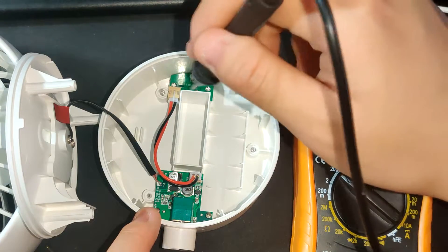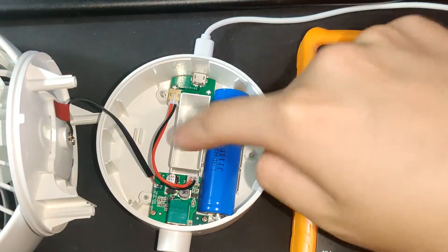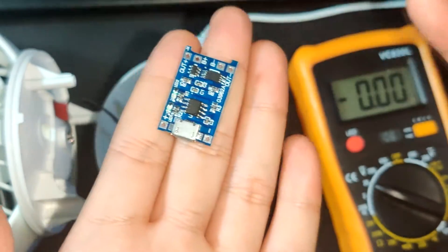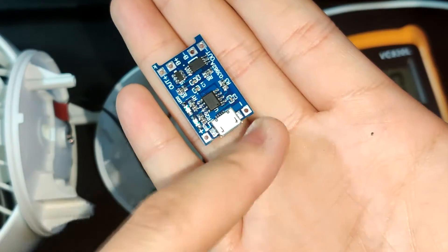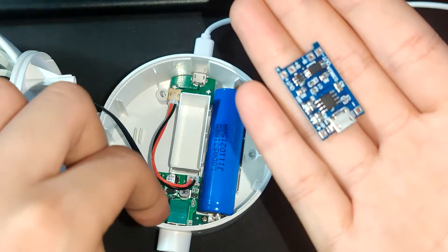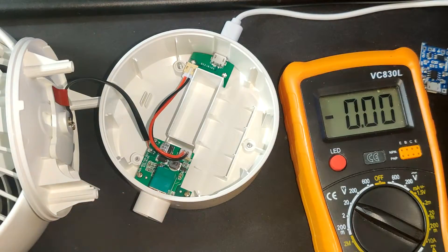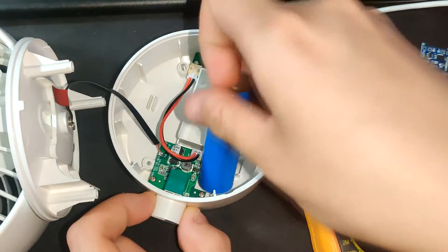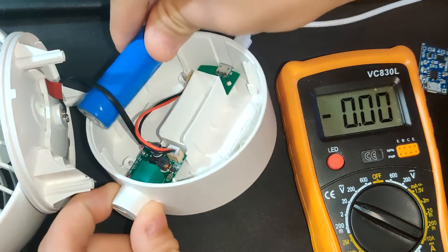It's just a power line so it doesn't need a huge motherboard. I'm going to see if I can put an LG 18650 battery into this and make it battery-powered. I have this little chip — I'll link it in the description below, it's less than a dollar. It's basically a micro USB plug-in with a protection circuit that charges the 18650 and provides output. What's funny is this fan already has a cutout for an 18650 to fit in — so that's clearly a future plan they had to make this battery-powered.